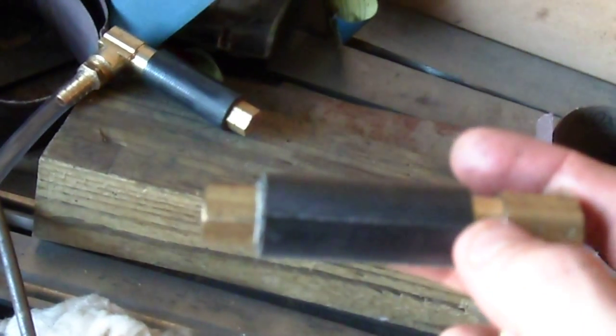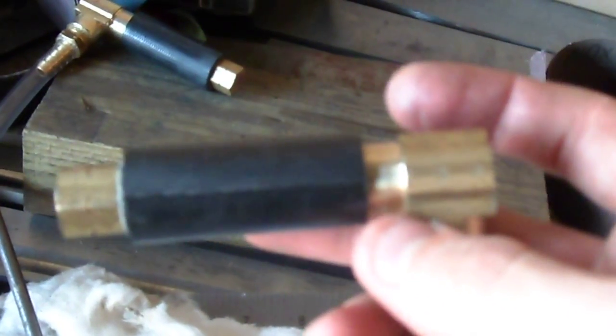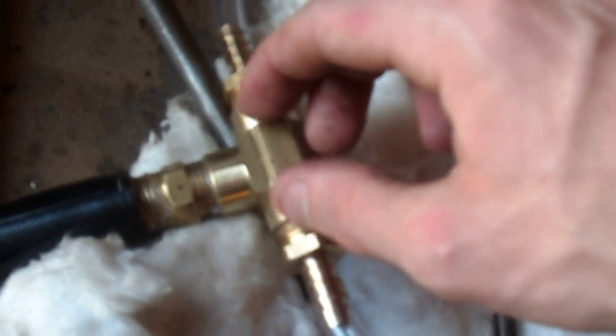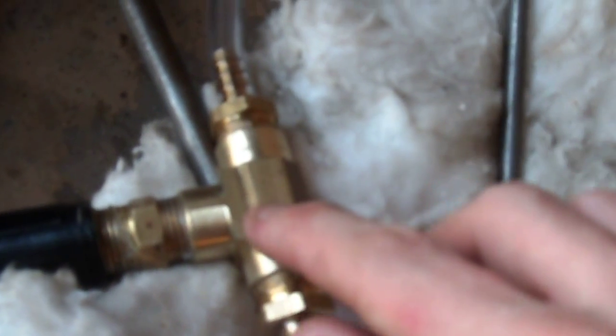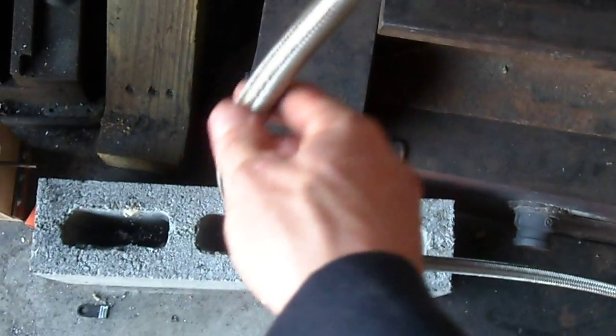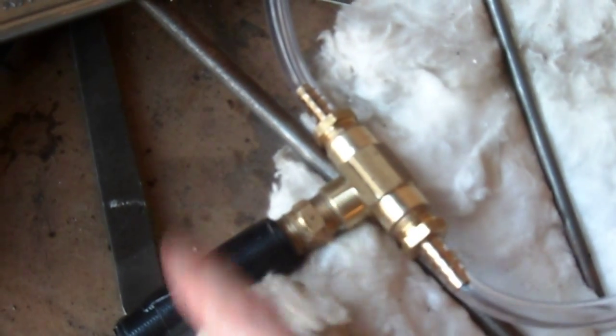Under the tape here I've got a two inch long nipple — basically just a small length of pipe that's got both ends threaded on the outside for the quarter inch pipe thread. And then I've got just this clear flexible tubing and then the same barbed setup on this little T-junction thing, which is actually a 3/8 inch diameter thread on these barbs on the outside and on this T-junction on the inside. Then just a little connector here to fit onto the hose, because the hose ends in a 3/8 inch interior female thread, which you need the little male coupler to fit this T-junction and the end of the hose together.